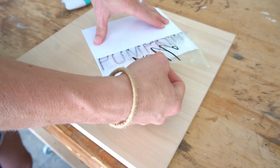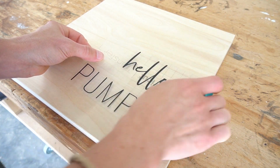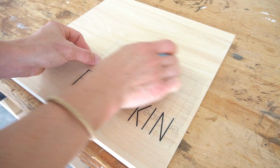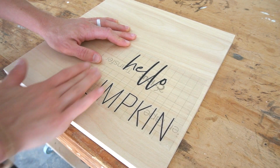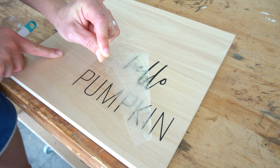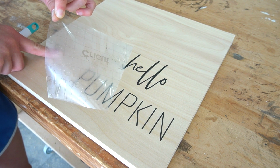Make sure it's sanded smooth, very smooth, like at least 400 grit. And make sure that all of the dust is removed. You want the vinyl to stick to the wood, not to the dust. It will also stick a little better if it's sealed first, so it may help to poly the wood first and allow to completely cure before applying. Make sure to use permanent vinyl and smooth it out really well before removing the transfer tape.